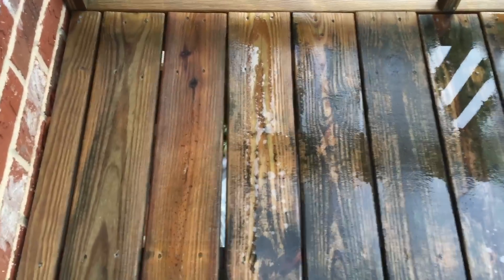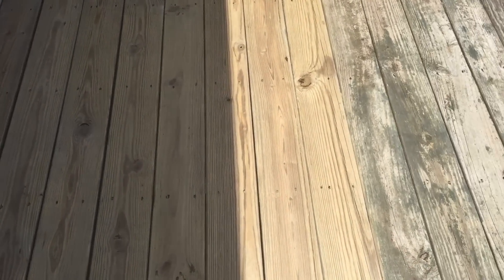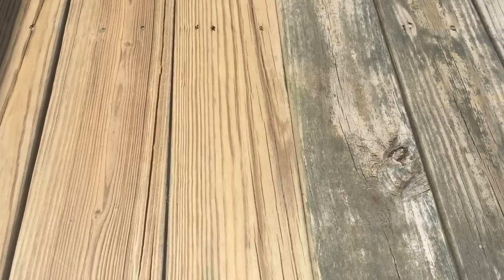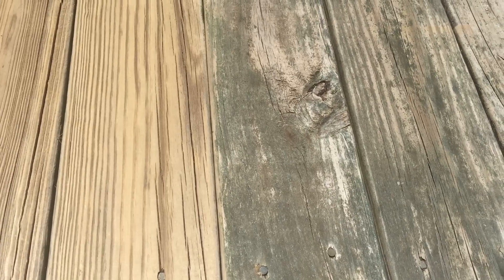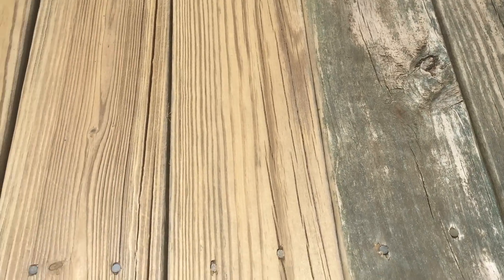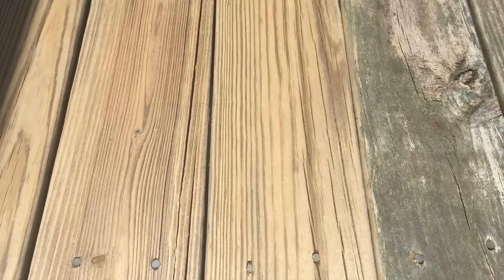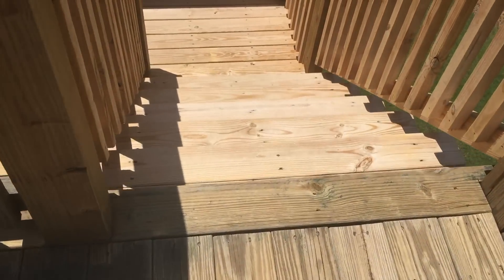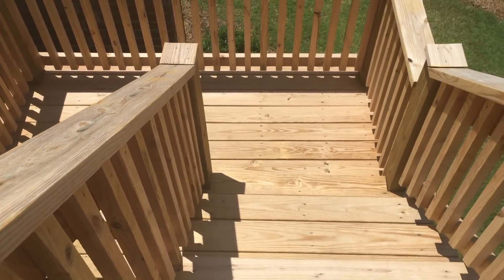I've cleaned a little under half of the deck with the Restore-a-Deck step one cleaner. You can see the difference here — it's hard to see in the shade but you can see the difference between the clean boards and the boards that were not cleaned. My boards were in pretty bad shape, looked like they were really grayed out and poor quality, but once I cleaned them they were restored to the natural wood tone. I have not put the brightener on yet so they'll look even nicer once the brightener is done. I just have a little bit of the deck left to finish, and I'll also do a light coat over the new wood on the steps to clean off any mill glaze. Then I'll come through and use the brightener on the whole deck.